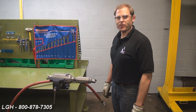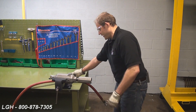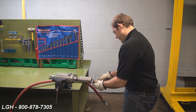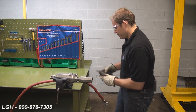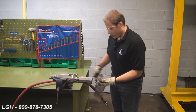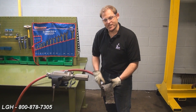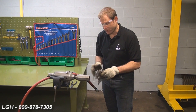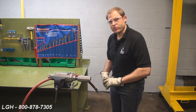Over time, the dirt stopper may also need to be cleaned. Simply grab a pipe wrench, loosen the end fitting with a set of needle nose pliers, grab the screen on the interior, open it up, and spray it down clean with compressed air. It's also a good idea to wash this with a mild detergent, rinse it, roll it back up, and repeat the process.